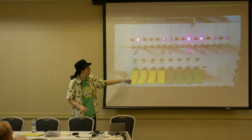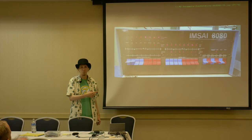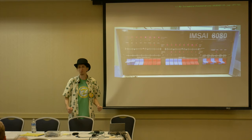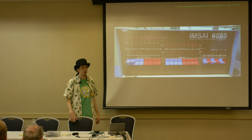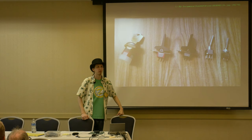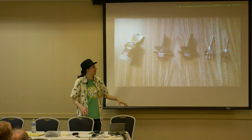Those big old paddle switches — I love them so much. I found that C&K with the J4 or J5 paddle is what I got my hands on. I bought the entire stockpile out from Electronic Goldmine — all 19 switches. I asked for 30 and they said sorry, we only have 19. I'll take them anyway. It turns out NKK makes something pretty close — a little crunchier but does a nice job. The nasty locking switches I was using for the address ones, I'm springing for NKKs for the next revision. The first one is just made out of found parts.